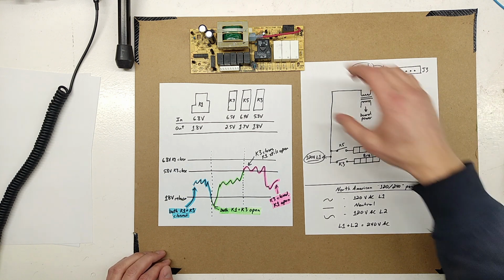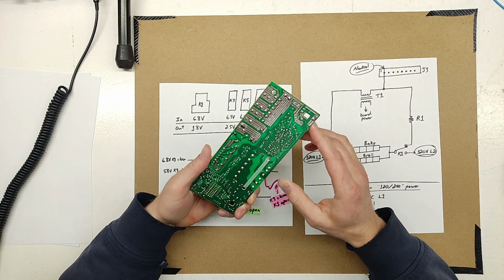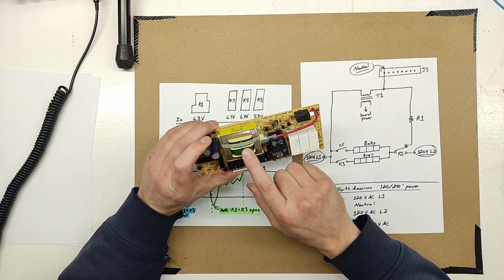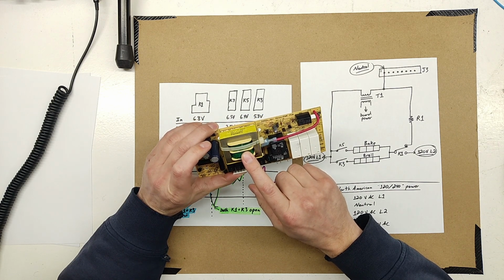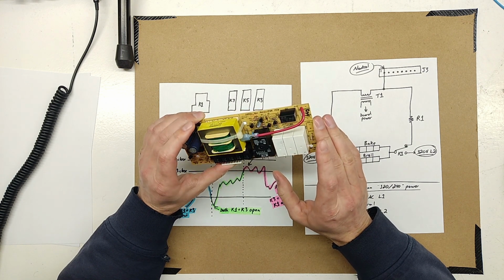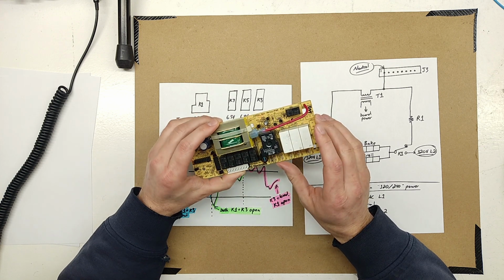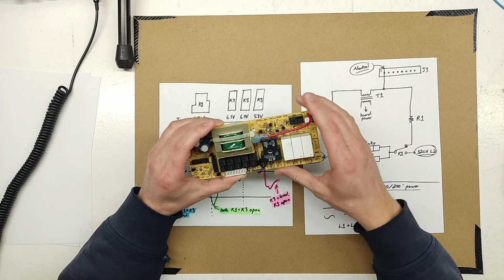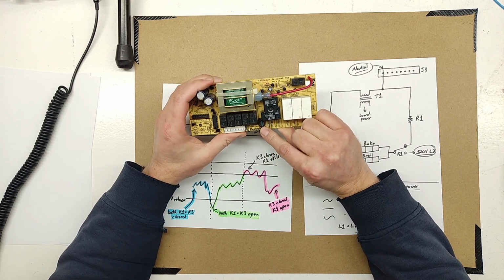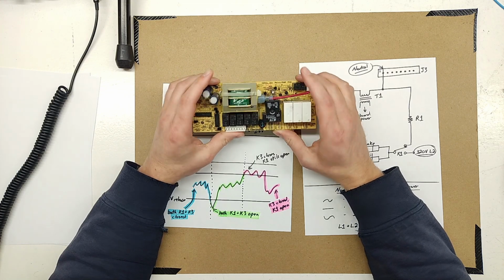So if that resistor was not in place, these boards would still go crazy because of the broken solder joints. The main board isn't getting power it needs to carry on coherent thought. So things would still be bad, but at least it wouldn't light on fire. I can't be 100% dogmatic about that, and I don't like changing the design of boards that I'm working on. So I replaced the resistor, but that's, for what it's worth, my opinion on its value to the overall circuit.